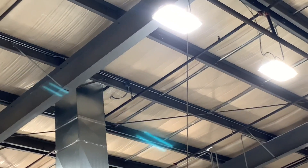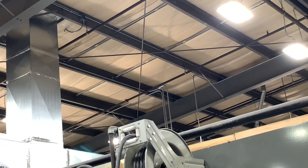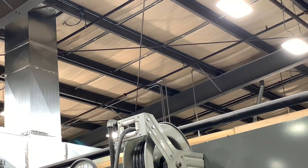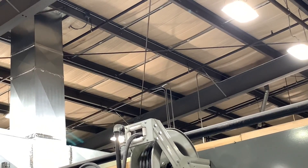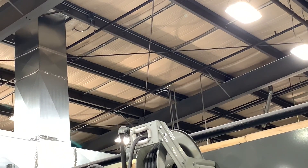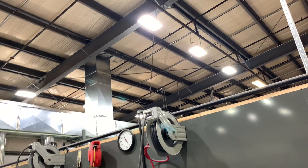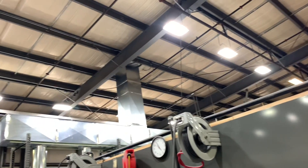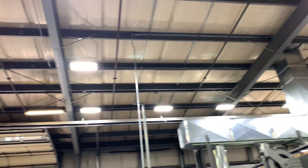There's a box with some type of flexible conduit going up to the roof for a rooftop unit, or for a disconnect on the roof for a rooftop unit. That was either seal-tight or metal seal-tight — LMC — or polyflex. One has a metal inside for watertight conditions and the other has plastic. Then another run of pipe coming in, which was the one I showed earlier starting with a 90.